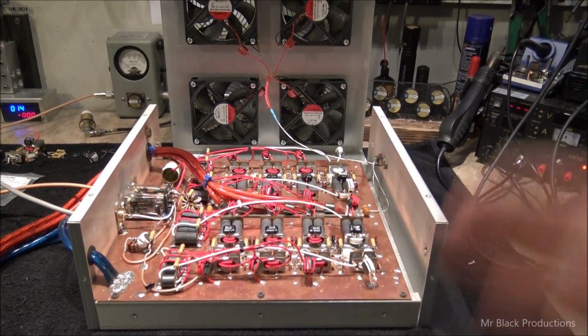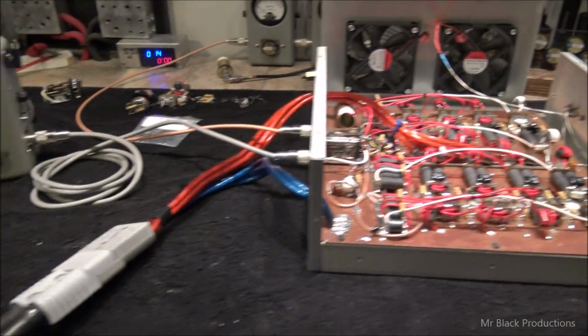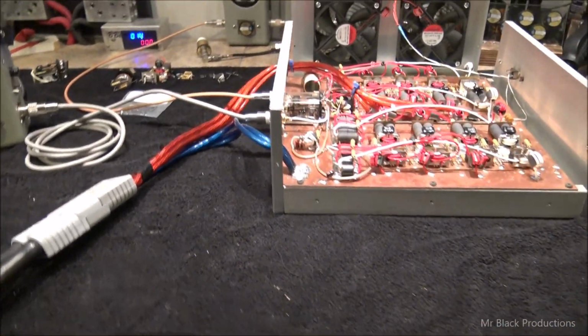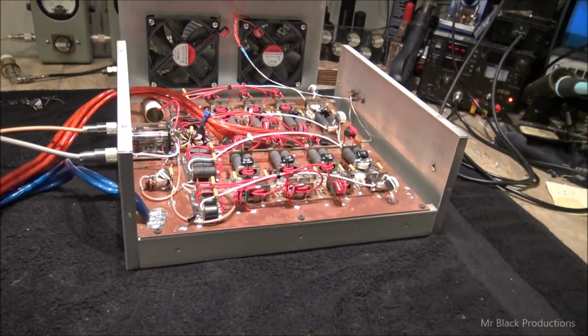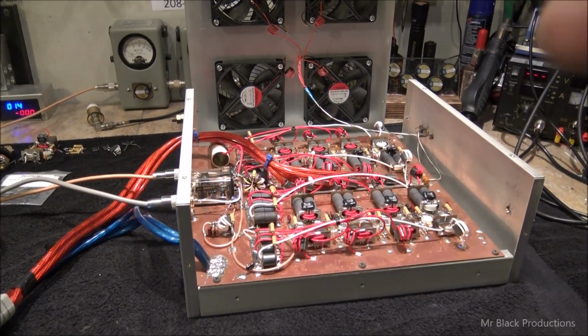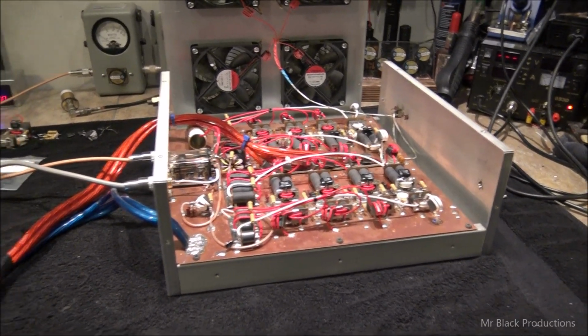But then when you bring the voltage up, the amperage drops way off. So we're going to run it on the 600 amp supply that's down below the bench, and we're going to run it on 15.5. So fully modulated when I go on audio, internally, the voltage on the box is dropping to 14.5, which is pretty cool.